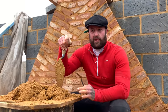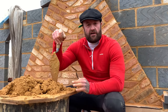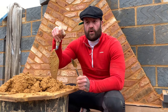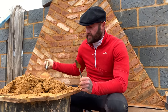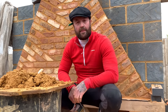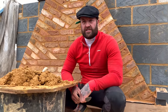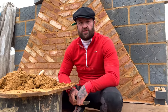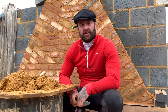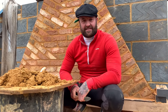Fortunately, I was taught by my peers, some great men who have passed, some who are still alive, retired, you know, and I was lucky enough to be in a generation where we did a lot of this work, especially up in London. Now, first things first, guys, know the difference between a buttress and tumbling in, okay? A buttress is normally used for support on walls coming in, pier structures at an angle, okay? Tumbling in is a different structure of strength from the brickwork, and also adds as a feature.